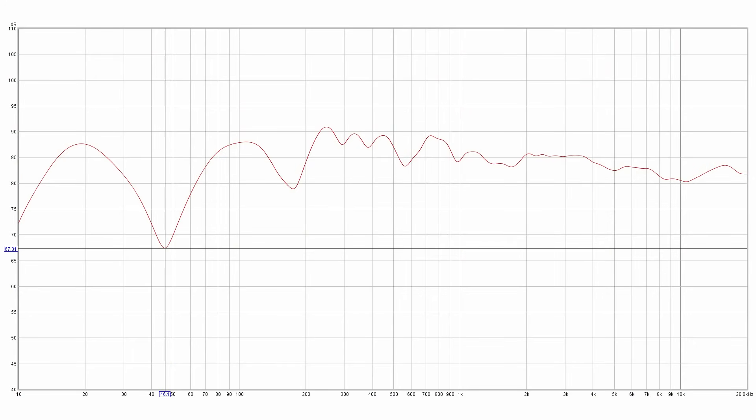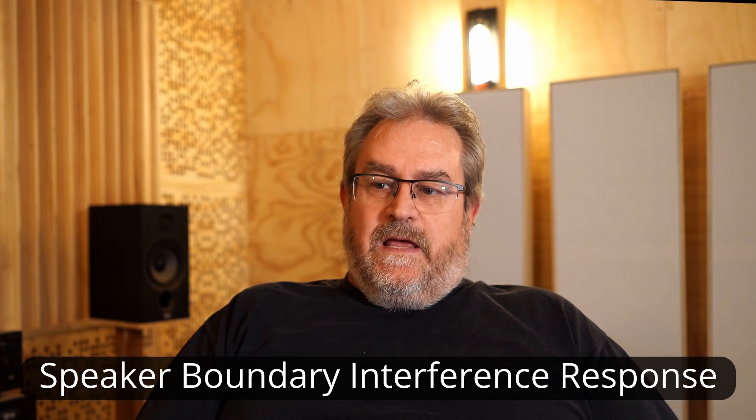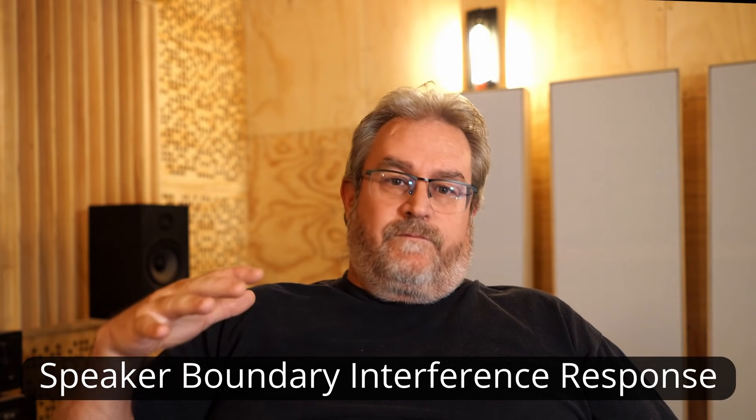This is the original position. Here's the measurement from the listening position I picked out — about 50 inches from the back wall. The speakers are placed 74 inches apart and about 45 inches out from the front wall. Here you can see a big problem in the measurement: there's a major dip at 46 Hz that's more than 20 decibels down, and it's pretty easy to hear.